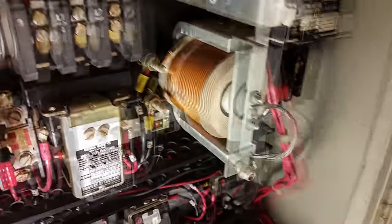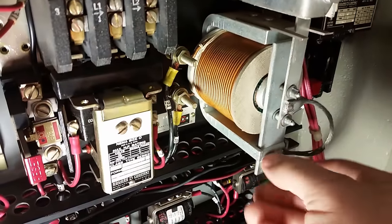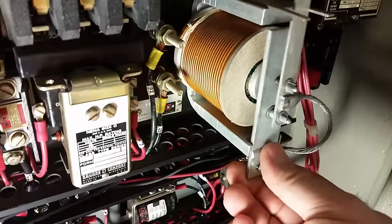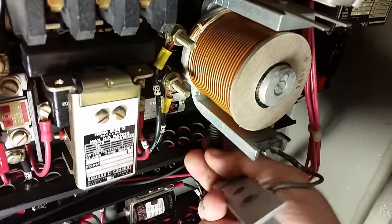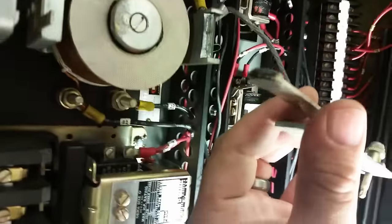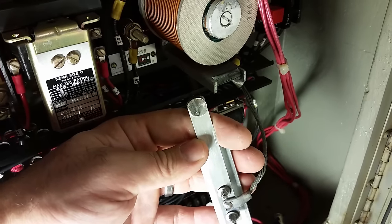Here's the quick slowdown relay. I'm going to check the contacts on it. This bar right here adjusts tension so it operates like that, and inside here is where the contact pulls in. This thing just rides on a pivot point and pulls out like that. You undo that spring — preferably not one-handed. This right here is a reversible part and only makes contact on one side when it pulls toward the outside. You can see that's where it makes contact — it's pretty burnt up, so I'm going to clean that up.